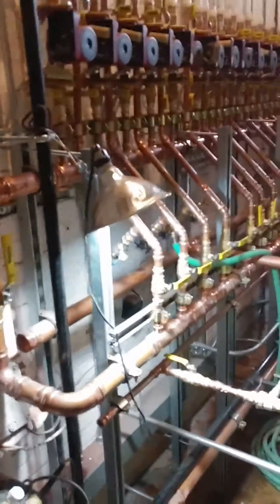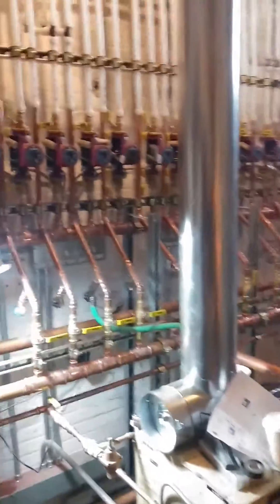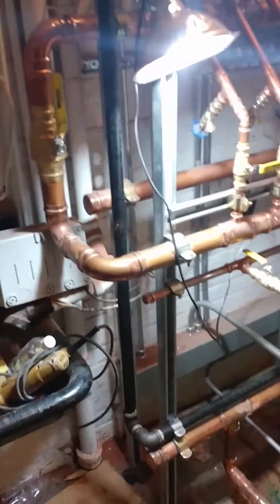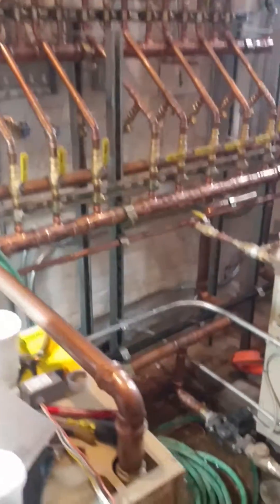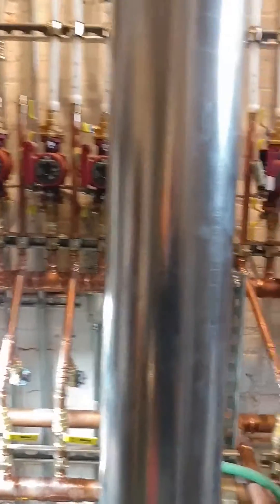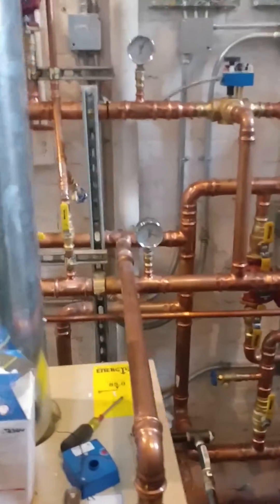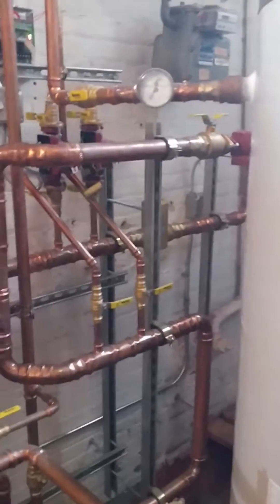Jeff, we're looking at the system we've just done. We've got two dual boilers here, 15 circulator pumps. We did the primary and secondary looping as per your instructions. We're feeding 15 risers with three-quarter inch PEX. We have the Tecmar 360 here mixing the radiators. We have the gauges, the expansion tank, and the hot water heater.